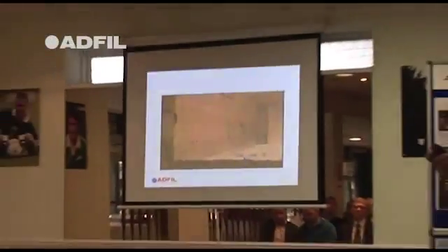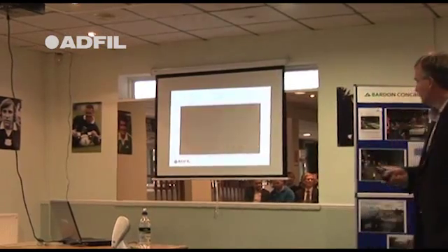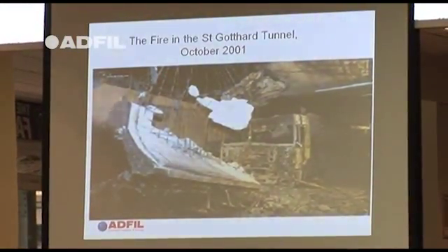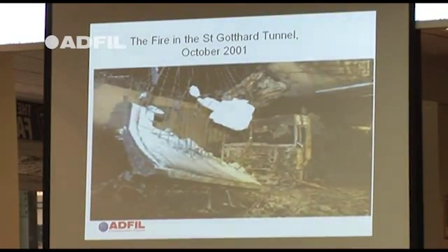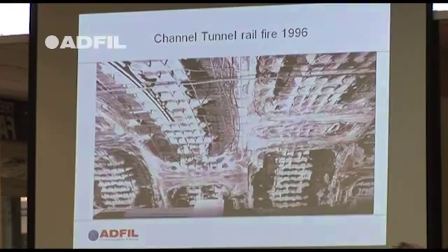So who amongst you thought that concrete was good at resisting fire? It's not. This is the Gotthard tunnel fire in 2001. As you can see, large swathes of concrete explode away from the surface and you get structural failure. This is the Channel Tunnel fire in 1996 — these dark areas are the actual rock. So the full thickness of the concrete exploded away from the surface, covering an area of around 50 linear metres. Interestingly, the repair that was done doesn't contain anything to prevent that happening again, and in the latest fire they spent 50 million euros repairing it — and still didn't prevent it. They repaired it with exactly the same type of materials that caused the problem in the first place.